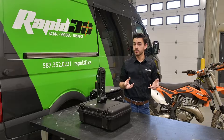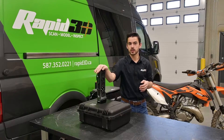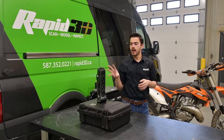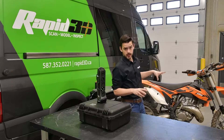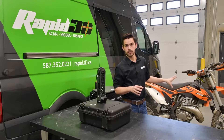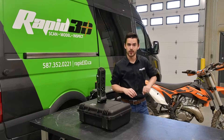In order to get all that geometry very quickly and very accurately, we're going to be using the Creaform GoScan Spark today. This is a self-positioned white light scanner and it can position itself based off of either reflective targets or the geometry of the subject itself. I think today there should be enough geometry on the underside of this bike to not require targets, but let's get the bike off the stand and see what we're working with.